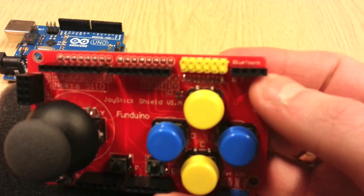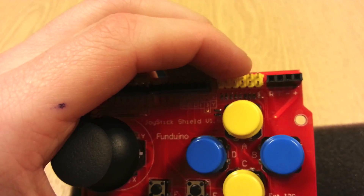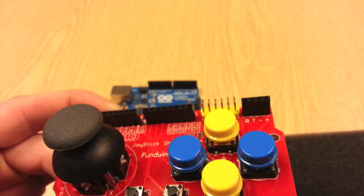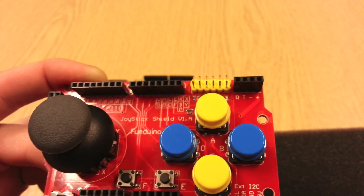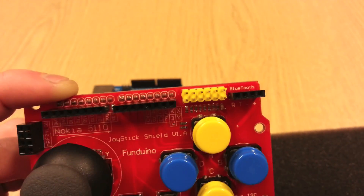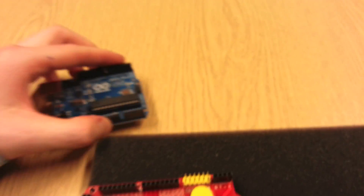In the top right-hand corner it says Bluetooth, with your receiver, transmitter, ground, and positive volts. This is brilliant because if you've got a remote control you will have a radio, and if it's Bluetooth you can just slot that straight in. I did try putting an XBee Series 2 in here — the positive and ground worked fine, but the receiver and transmitter were giving different characters than expected. I imagine that's because this may be wired specifically for Bluetooth. I've got around it by putting my TX and RX into the TX and RX pins on the Arduino Uno, which I'll show you shortly.